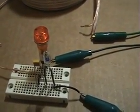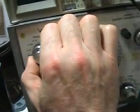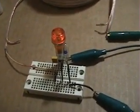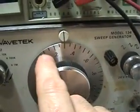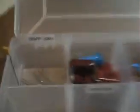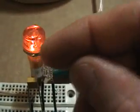I'll sweep the entire spectrum. We've got nothing — the neon bulb is not coming on. I'll jump to the 1 megahertz range and start sweeping slowly. There's our hot spot. We're in the 300k Hertz range where this is resonating. I've got the 390 picofarad capacitor here — it's resonating, but look: this bulb is lit. That's amps — and that's what we don't want.